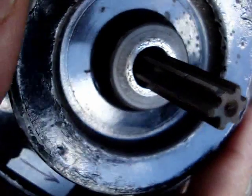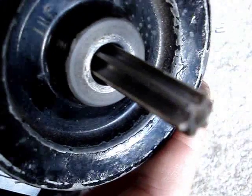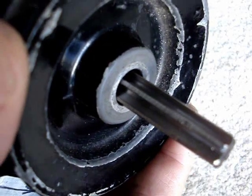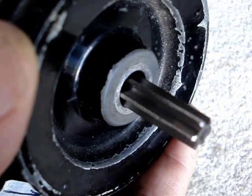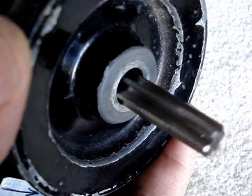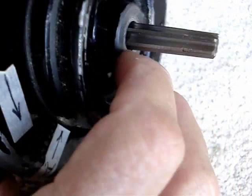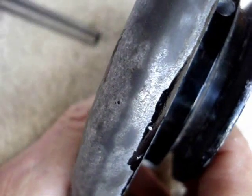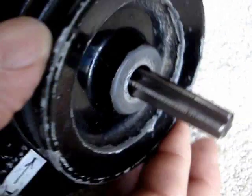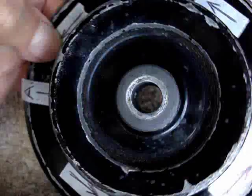So 50 thousandths at the small end and none at the big end. The question is what is the taper? It could be the same taper as a taper pin, which is supposedly about a quarter of an inch per foot. The taper on a Morse taper reamer is more or less five-eighths of an inch per foot. The overall width of this central hub — I haven't measured it yet with my dial caliper — looks to me to be very near approximately an inch. Trigonometry folks out there need to tell me if this is consistent with a taper pin.